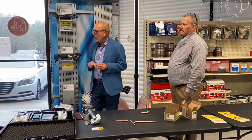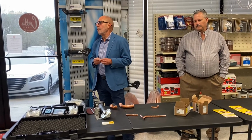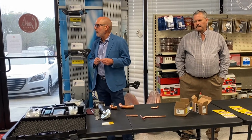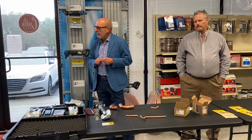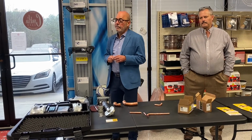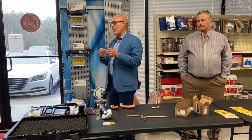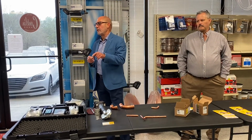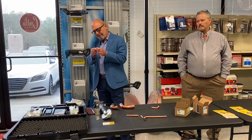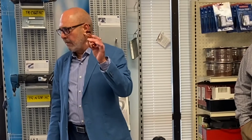Okay. Soft copper is an advantage. It is. Copper that you use on plumbing is either K, L, or M, and it's hard copper. Pressures in plumbing for water is about, maximum pressure will be about 250 PSI. For refrigerants, when you do a hard press on copper, you're gonna have some very small cracks on the system. The life cycle of this fitting for refrigerants is about 2 years.